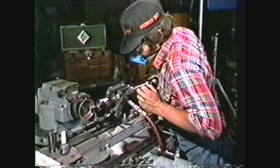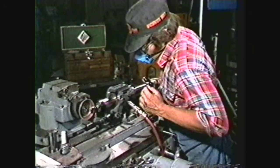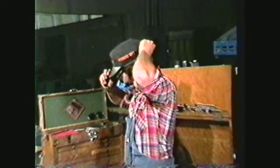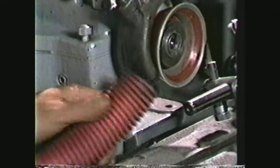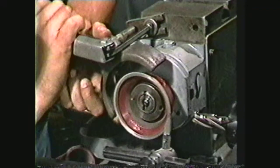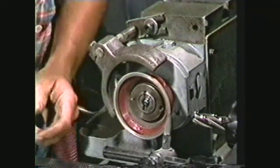Whenever you are grinding and sharpening tools, you must observe certain safety procedures. Always remove watches and other jewelry. Wear safety glasses with side shields and a face mask. Wear a hat and an apron. Always use a dust collector when grinding, since most tool grinding is of the dry type with no coolant. And make sure wheel guards are in place before operating the grinder.